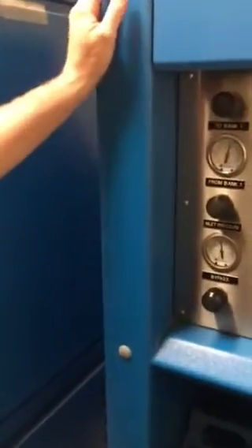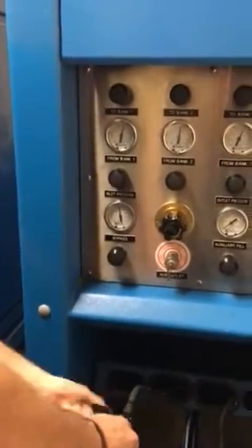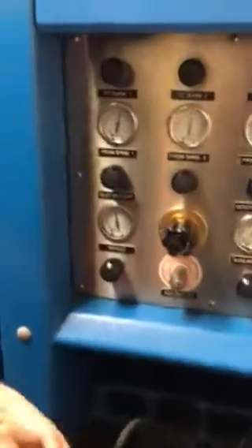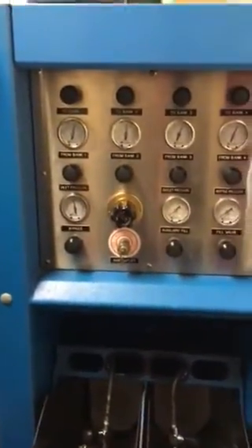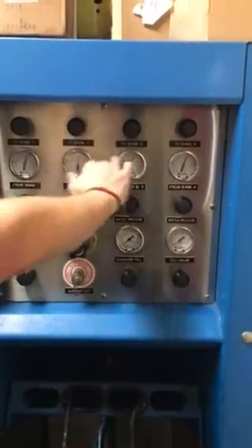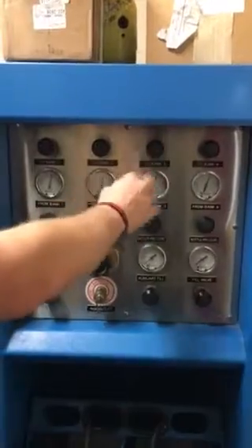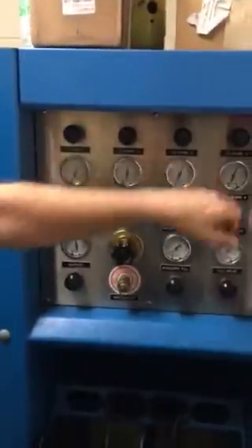When you released all the pressure there, you basically released all the air pressure coming into here — you did not release the rest of the banks. From here down, there's no pressure on the system itself. If the fill banks are below the pressure of the bottle, you have to fill them up so the bottle itself can be filled. To do that, make sure all your banks down here are closed. Open these, let all the cylinders equalize — open each one of them. Then come over here and hit your power-on button to turn on the compressor. The compressor will run and start filling up your banks. It is an automatic shut off. And that's how you fill a bottle.